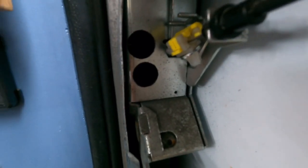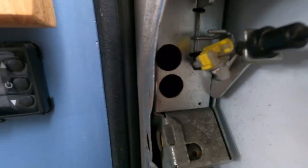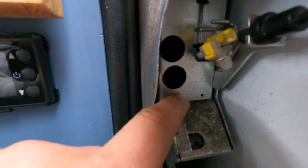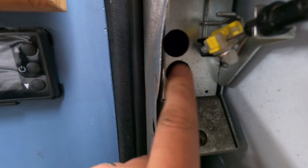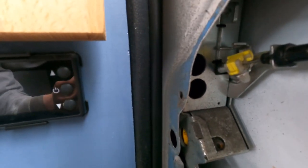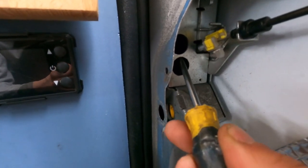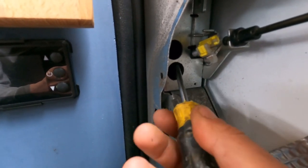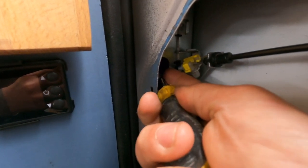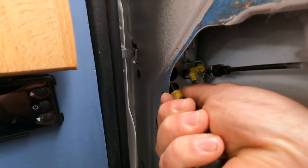Just for reference as to where that hole is: we drilled the top hole first and couldn't quite get on the latch, so we drilled a second hole about 15 millimeters from the bottom, right next to the edge of the locking mechanism. Again, you go in and aim the screwdriver diagonally up until you can feel the latch. Once you've got the latch, push up on the screwdriver which will cantilever it against the metal, actually pushing down, and you can pop the latch.